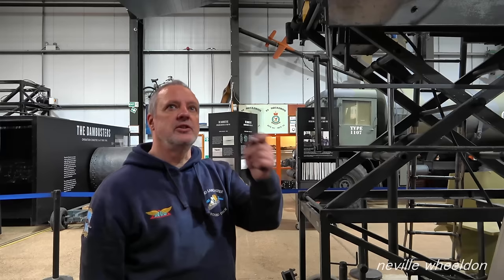Have you got the primer pipe in now? Yes, all the priming system's back in. It's all fitted in, it's all clamped in. So when we get the opportunity we need to put some fuel in the starboard tank, number two tank, and basically get rid of the air out of the system, and then go for a dummy prime, and check that it's actually drawing the fuel out and everything, and also flushing the pipes out as well.